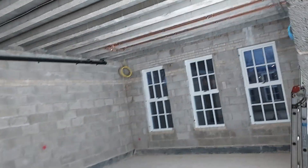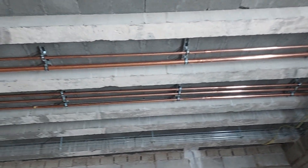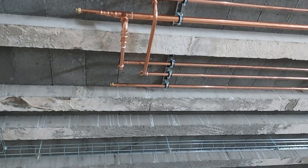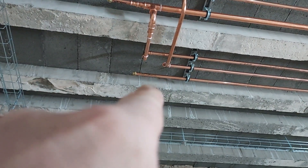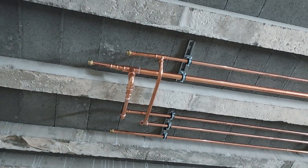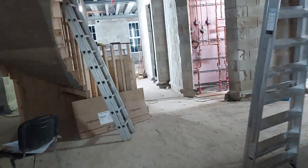This is a cinema room. Just above is a master ensuite bathroom. We've got the link-overs for the secondary circulation here. At the end we've got: cold water at the back, then hot for the showers, and hot for the basins — that reduces down to 15mm to go to the basins. The underfloor should be going in in a month or so here, then I've got to come back and commission everything for that. A bathroom fitter will be doing all the bathrooms.